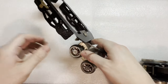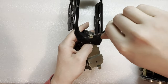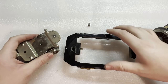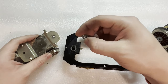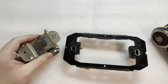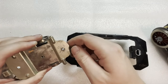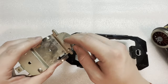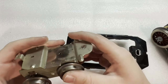That screw came right out, so I think maybe this one is just a little bit stripped at the end. Well, it's not exactly how I wanted to go about things, but I wasn't really left with much of an option, so I just went ahead and cut the screw off. I know I'll be getting some replacement parts anyway, so I can just order a replacement for that, or even use something standard if I run out of options. And I'll see if I can re-tap that hole too to the correct threading.